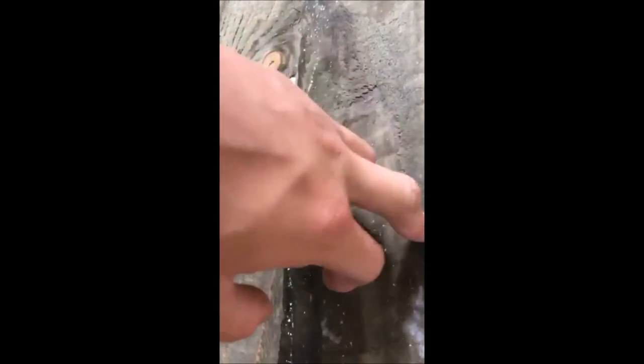Now I'll cut this piece off the end. You can see where we've gone over the end - because we're going to have decking down here, and also when the rain comes, because these boards are flush - they're 4.8 meters - it'll just seep through the gap here and fall down the face. We've done the same round the back here, I think that's about 40mm overhang. I still need to nail another plank, probably just guesstimate it to be honest.